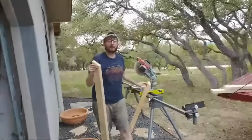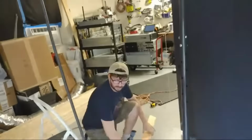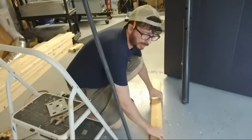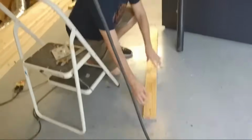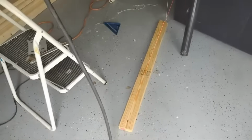And this opposite edge should be used on the other one over there. So I've got the laser level already queued up there. I'm going to turn it on just to make sure that I get this perfectly aligned when I get this in place here. And we want to be right at 34 inches because we're going to put a 32-inch door in here.